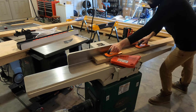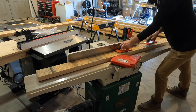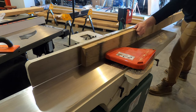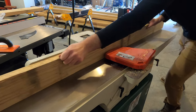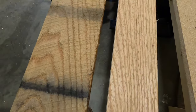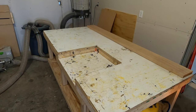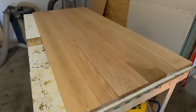This is just the basic milling process. The first thing we do on the joiner is to joint one face completely flat. Then whenever we have that face flat, we'll put it against the fence and we'll joint one edge. That way the edge of the board is not only flat, but it's also square to that front face that we joined previously. Here is a closer look at one of the boards that has been milled versus one that is still rough sawn. I repeated the process on all of the other boards until I had them to the width that I wanted the tabletop.